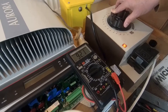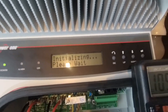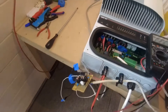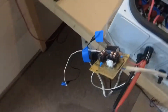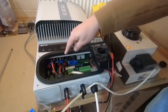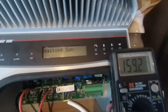Are we going to see anything working? We're getting close to that magical 90 volts — I'd expect to see something soon. So that's excellent. We'll pump in about 120 volts, being very careful to keep well away from all this conversion equipment and anything with exposed connections. I've tried to isolate as much as we can but that circuit board is definitely live. It's saying 'waiting sun', which means we haven't actually got enough DC voltage coming on the string yet for this thing to be happy that it can start generating. So let's crank this a little bit more.